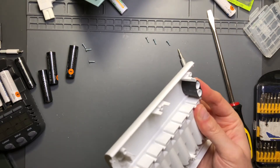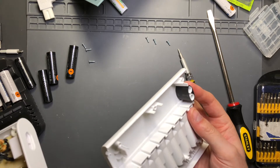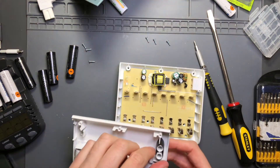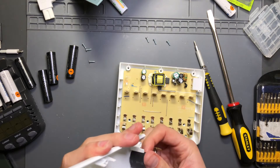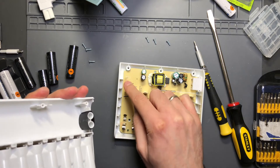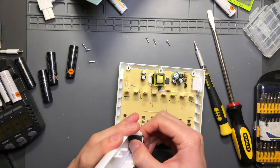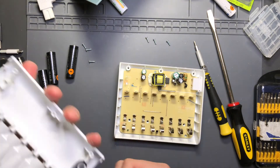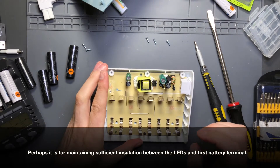Interestingly, they wrap the LEDs that are bare. This must be line-referenced - actually, no, because you can touch the contacts. There's the board - I'll talk about that in a second. There are two LEDs here. Unless these LEDs are on the non-isolated side of the supply - and this is supposed to be double insulation. But then what about the top part where you touch with your finger? There's no insulation there besides the plastic - that's weird. Here's our battery charging circuitry.